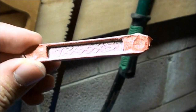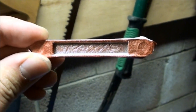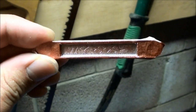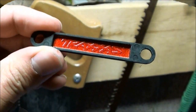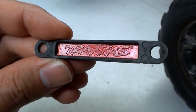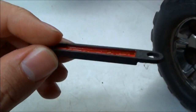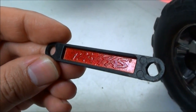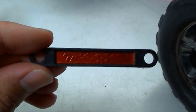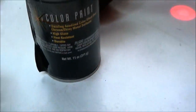If the part you're painting is already silver, then all you have to do is jump straight to this step — do a couple of light layers followed by a medium, then let it sit for 10 minutes. Come back and do it over and over again until you achieve the desired look. After spraying it down four times over 40 minutes, I am done. One of the downsides is that it takes seven days to set properly. However, it only takes about an hour to become dry enough to touch. If you're using it on metal parts, I would definitely wait those seven days before testing its endurance. I've tried numerous different types of paints and this stuff really does have the best finish.